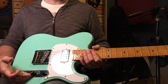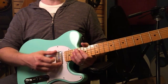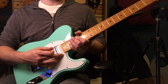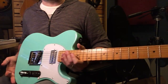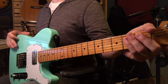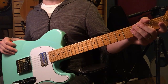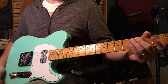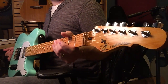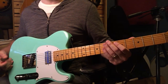Another change I made was replacing the volume pot. The old knob wouldn't fit, so I replaced the 250k pot with a 500k pot. I did that first to see if it would brighten up the stock pickup, and it did open it up a little — but not enough to stay with it. So I left the 500k in and put the DeArmond pickup in. The other change you might notice is the neck — it's not the stark white neck you'd have gotten stock, because I cannot stand stark white wood. That's a personal aesthetic preference. So right over the poly satin finish, I did a Trans Tint and True Oil mixture, a couple of coats. There are people who say that won't work over poly, but it seems to have worked just fine. True Oil has a hardener in it, so it's not an actual oil. It's got a bit more amber to it now, which I think greatly enhances the aesthetic and makes it look a little more classic.